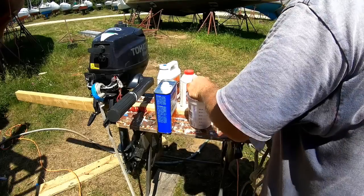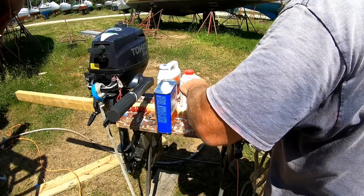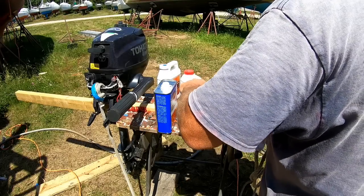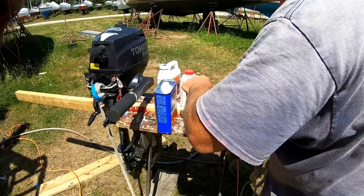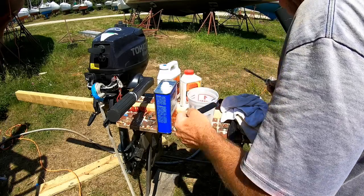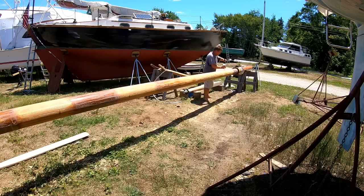The hope is that the epoxy base will increase the longevity of the varnish, as well as make the mast more rot resistant, and also toughen the surface of the wood and make it less prone to getting nicks and dings from flogging stay-sail cringles, for example.